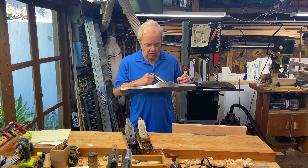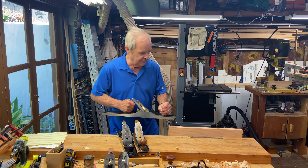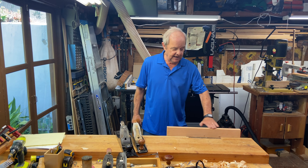This plane is very long and very heavy and it's called a jointer plane. Some people might mistakenly call it a jack plane, but it is not. It's specifically designed to smooth out undulations in the edge of boards so that you can glue them together without leaving gaps. It's able to do that because of its extreme length — it rides over the tops of ridges and smooths out the areas around gullies. This is not a jack plane.